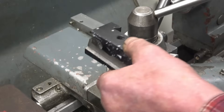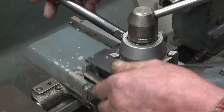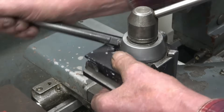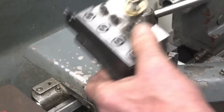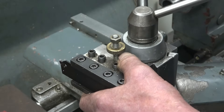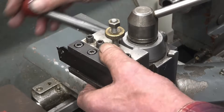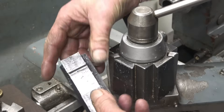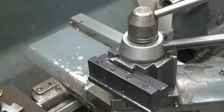The standard tool holder is a lot, a lot tighter — and that's locking in. And then the one I normally use, which is the one I made myself, that's tighter as well. So I have, in fact, made a mess of it. But I'm sure I'll be able to pull myself out of it by putting some silicon bronze on there and then remachining it.